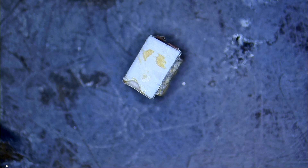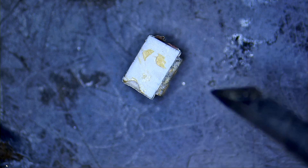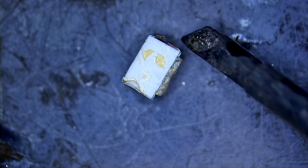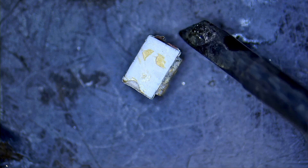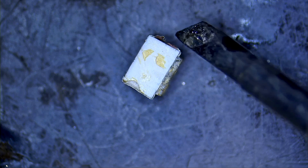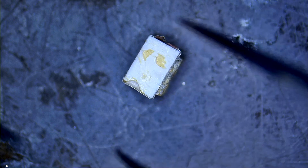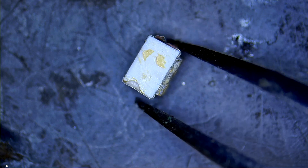So we're going to use our soldering iron, but we cannot touch the tip with the component. When we attempt to solder it on the motherboard, we're going to use our NF.mini soldering iron - the very tip of the tip - to apply heat to the pads on the board. That will liquefy the solder, and the solder will attach itself to the sides of the infrared component without touching the component directly. Before we do anything, let's take a look at the motherboard.